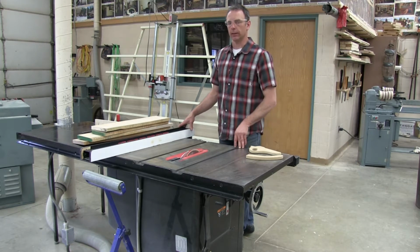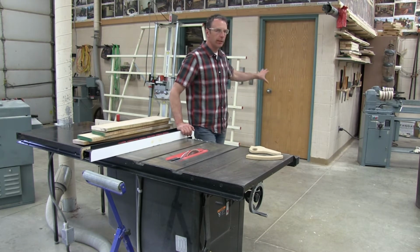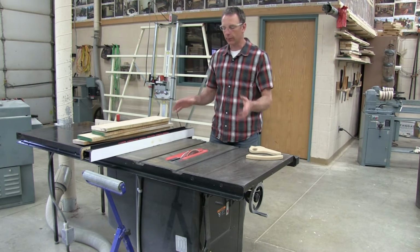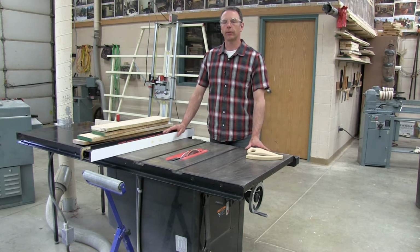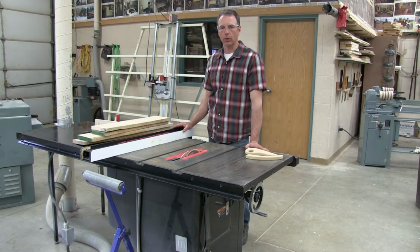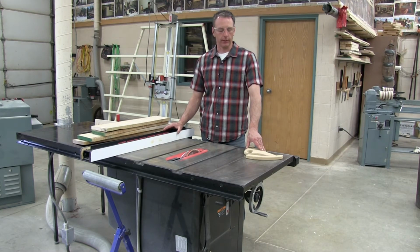Kickback can happen straight back or sideways, like I was saying. We've purposely placed the table saws at the back of the shop for that reason. If people are behind you, first of all, you should be considerate and ask them to move in case kickback happens. But as another person in the class, you should also realize that the table saw is being used and you shouldn't walk behind the people using it. I've heard many stories of kickback happening and seen some videos of it happening. You can probably, I'm sure, search it up. And I've seen a 2x2 go through a cinder block wall on video when I was going to school. And I've also seen one stick into a door, if you can see that back there. So kickback happens fast, and it can be lethal.